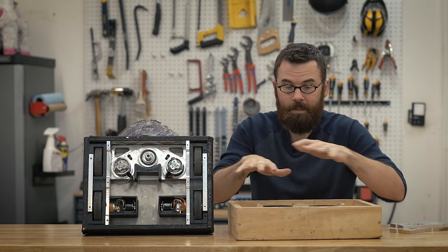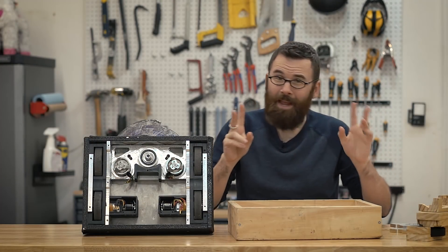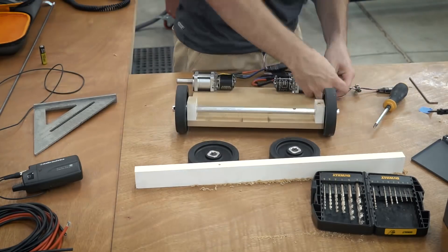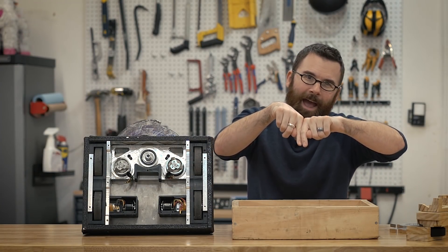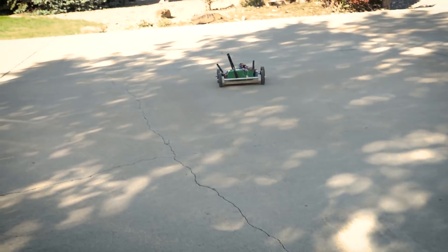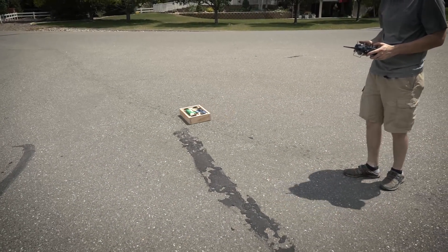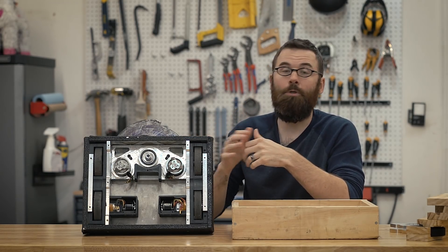After I got all that figured out, it was just a matter of physically prototyping everything out. I prototyped everything out of wood — I have all the early generations of the drives, and I even have an early, rudimentary chassis that was roughly the same size as what Crippling Depression was going to be. I actually did two full chassis. The very first one was basically a piece of plywood with gearboxes bolted to it and dead axles in front — just a hole drilled into a block of wood with a half-inch shaft running through it — mostly just to test the ESCs, the radio, and brushless drive in general. Once I figured out that roughly worked, I moved over to a second version, built the drive boxes, put those together, bolted them inside the chassis, and figured out how that was going to work.